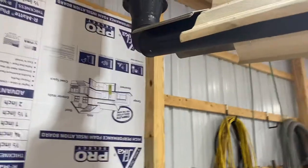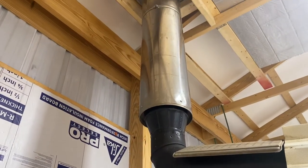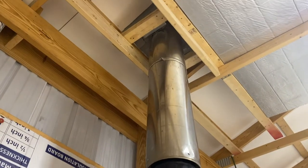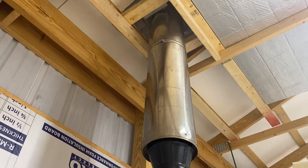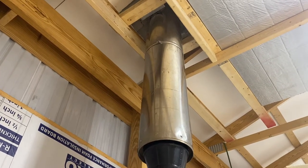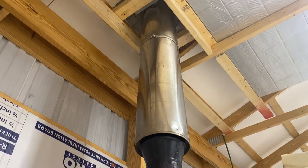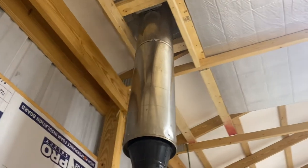From the six inch pipe, I have double wall insulated eight inch pipe — about 10 feet of that going up through the roof with proper supports. This is Metal Bestos SS, which has also been rebranded. I can't remember the name anymore, but you'll find it. These sections are about 300 bucks each — way too expensive. Look online and try to find some.